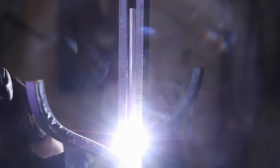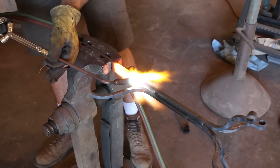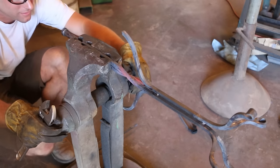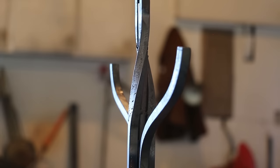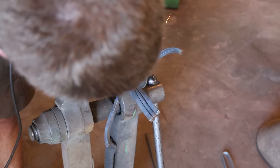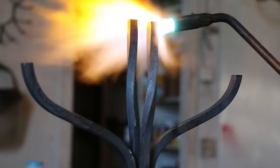I wanted to spiral the top two centerpieces so that all four uprights would be in a single line. I cut a piece of 3/8 inch round bar that fit tightly in the middle and tacked it in place temporarily, thinking this would help keep the two pieces spaced evenly as I heated and spiraled them. It worked really well. One thing I've learned is that you really need to heat a ways past where you want the bend to start, otherwise the bend will be a lot shorter than you planned. Also for a spiral, it's really important to heat the whole length of the spiral evenly if you want the bend to be even. I cooled it off and then cut it to length. The top tacks on the temporary centerpiece I placed high enough that they'd be above the cut, but the lower ones I had to carefully cut without cutting into the square bar, and the round bar popped right out.